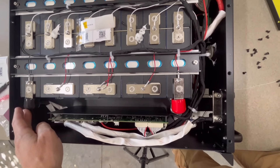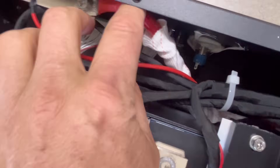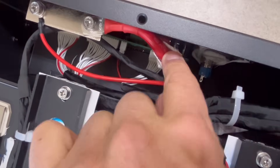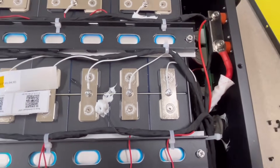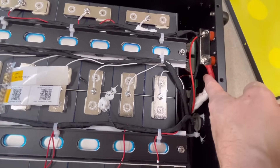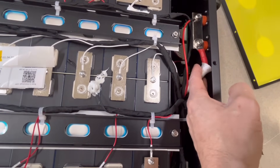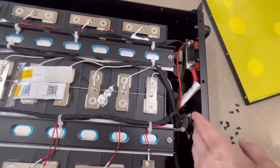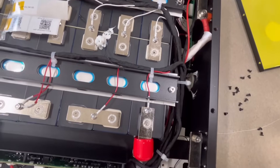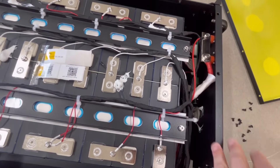The cells are compressed with two metal plates, drawn in and bolted down. The main negative runs from the main battery terminal to the BMS and then to the bus bar — those are two 8-gauge, 200 degrees Celsius cables. The main positive is 5-gauge, 200 degrees Celsius. I would have preferred 4-gauge there, because they send 2-gauge to attach to the bus bars from this battery — so the internal conductors being smaller seems inconsistent.